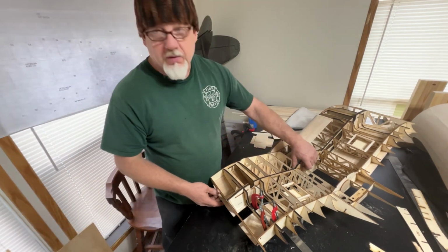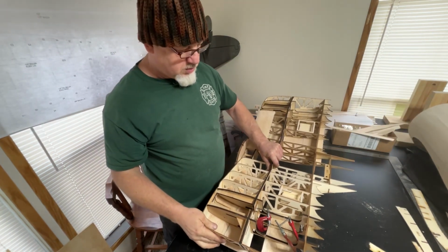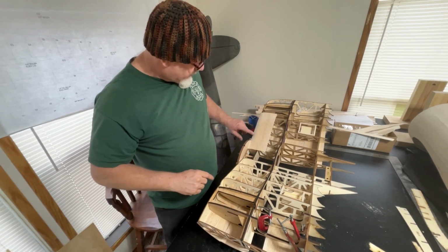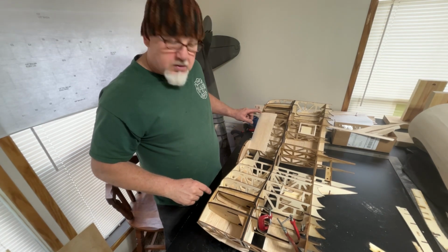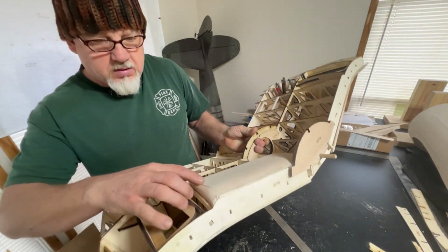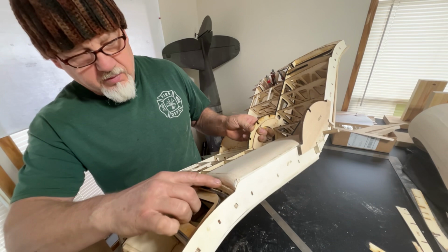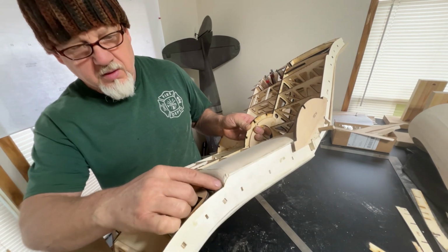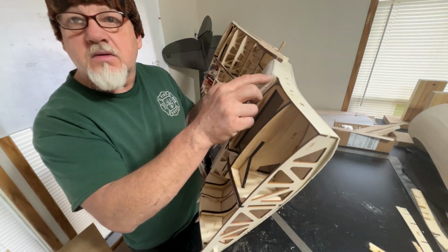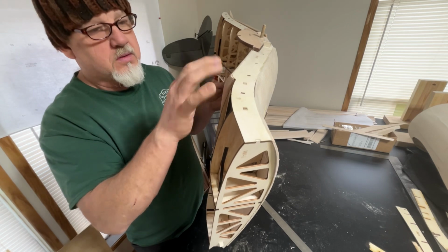These ones here are really hard with the bending it this way and this way. That's the hard one. This one here, it's just one direction. There's a little bit here in the front like this one, but it's separated right here. And I guess I can show you how I did that. There's that former in here. And I took, I think it's 3/4 by 3/4 and put in there, or 1/2 by 3/4. And then I just tapered it. And when I did it, I didn't get it all the way to the front, because you're going behind this lip.